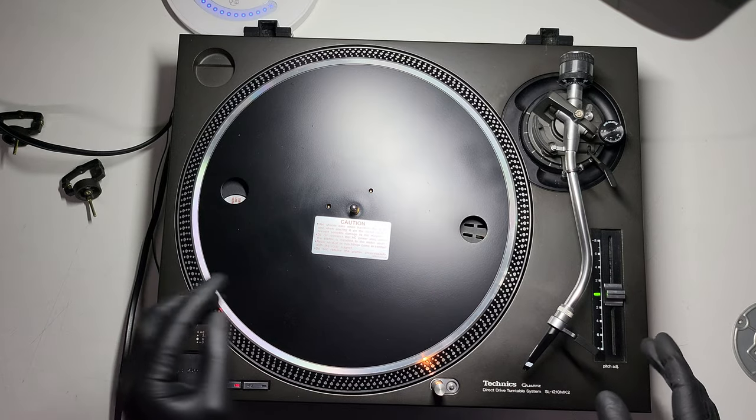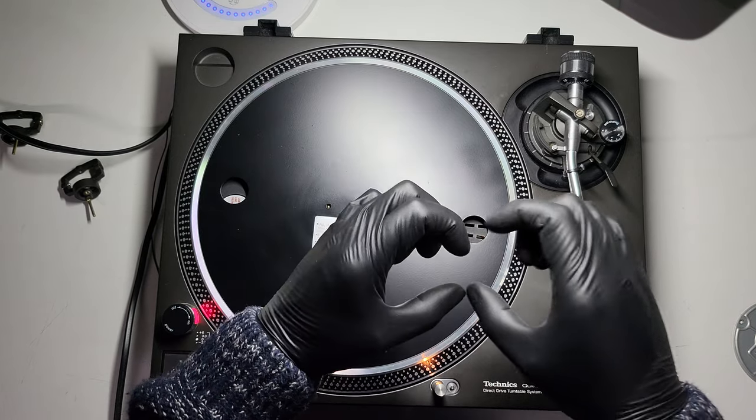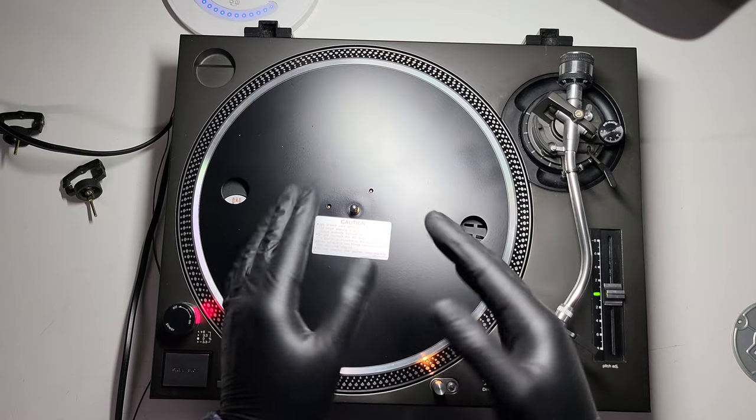Best way of checking: turn the turntable up on its side slightly, look underneath, and you'll be able to see the cable and the plate. Anything with aftermarket thick cables attached will usually not have the support blocking plate. That can save you money on the PCB and the support block itself — I wouldn't let any turntable leave here without that in place.